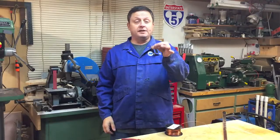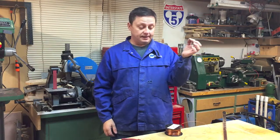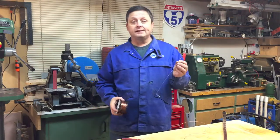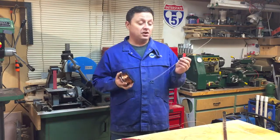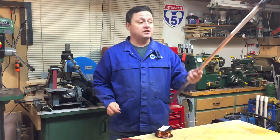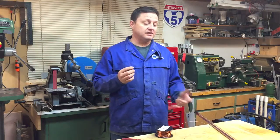So there you go — you spin that up for about 10 seconds and you have a nice straight MIG welding wire rod. This costs about a tenth of the cost of a package of filler rod, and typically when you come to thin metals it's kind of difficult to find that stuff.